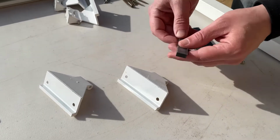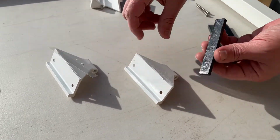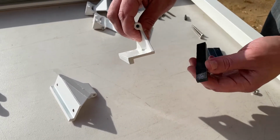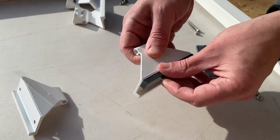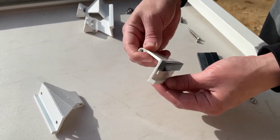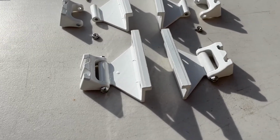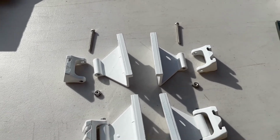If your installation uses brick mold trim around the door frame, you will need to attach the included shims to the wall brackets. Peel the adhesive and attach a shim to each of the 4 wall brackets as shown to ensure a flush installation. If your installation uses a door frame with nailing fin only, discard the 4 shims. At this point, you should have 2 fully assembled brackets and 2 loose sets.